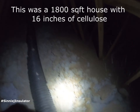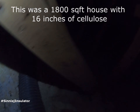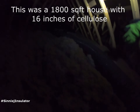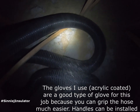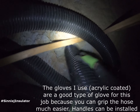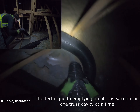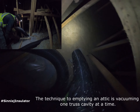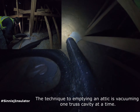Alright, let's get started with the removal process. Now as you can see, the insulation is covering the 2x4s, so when you're walking in your attic you definitely need to remove the insulation so that you can see you are stepping on trusses and don't go through the drywall. If you are new at this, you can definitely bring a piece of two by six so that you can walk on it in between trusses.